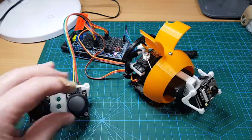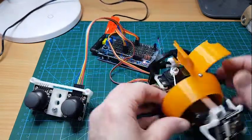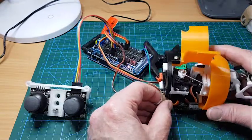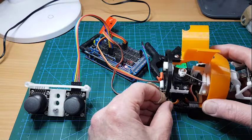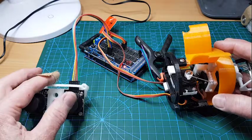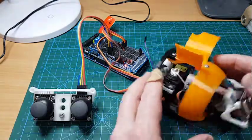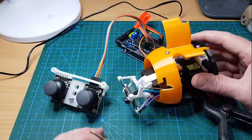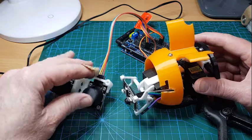Anyhow, that's the basic mechanism. It works from these nice little gull-wing inspection hatches, which are sort of a happy accident — I just cut one of the top bits apart and peeled them back. As you can see, there's a servo there which connects to that arm to pivot backwards and forwards, then mounted onto the front of that servo is another little gimbal mechanism for the up and down.